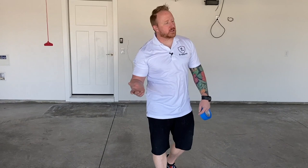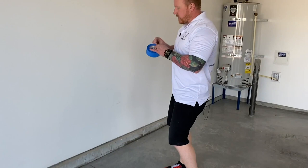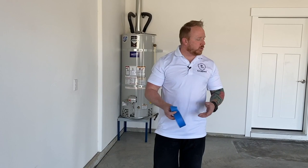We're getting ready to put the patcher paste in the cracks, and we want to give you a little tip of what you can do to these cracks. Now, you don't have to tape off the cracks, but it can make the grinding go a lot faster if you don't have a very powerful grinder or you're using a small grinder. This is also the same process you would do to caulk and fill these with a silicone caulk later on when the floor is completely done.